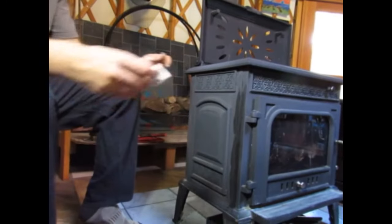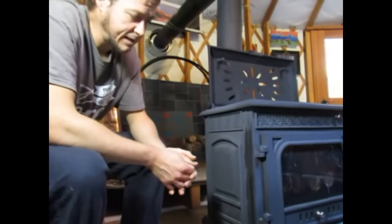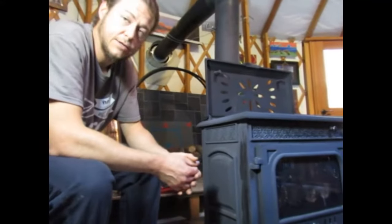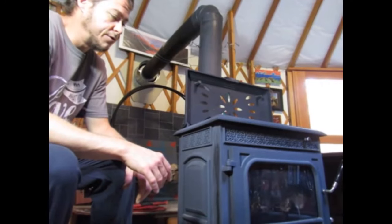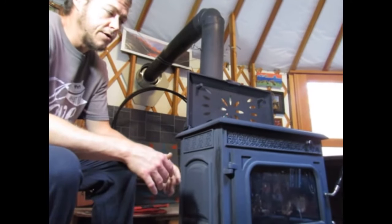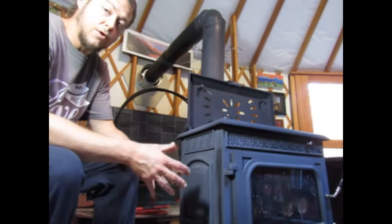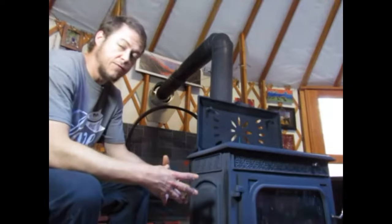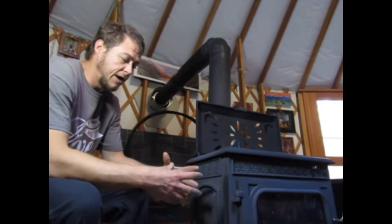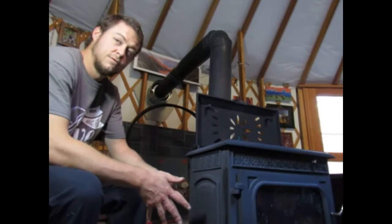And there you go. This is how you fill cracks on a wood stove. After you get done sealing all sides, you want to start a small fire, a light fire for approximately an hour, and let that burn through, and then start a bigger fire and let that harden it off, and that'll seal it up tight for you.